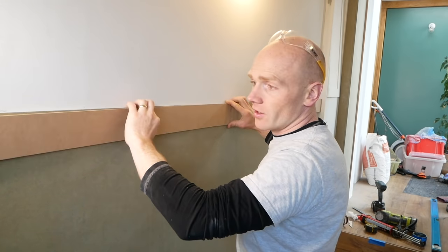All right, now we're onto the really fussy bit, for me at least. I'm going to take this skirting board along, up a few mitres over the step, and then replicate that on the other side. Then down here, I've kind of messed up with the step. I should have kept that laminate a little bit longer so that the nosing could slot over it. So I need to rethink that, but I'm going to fit it in between our skirting boards.